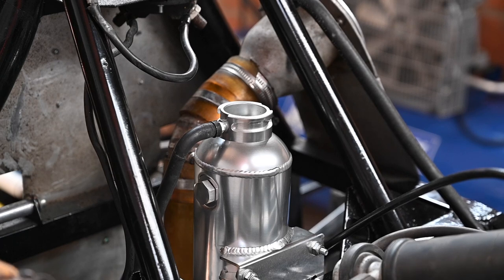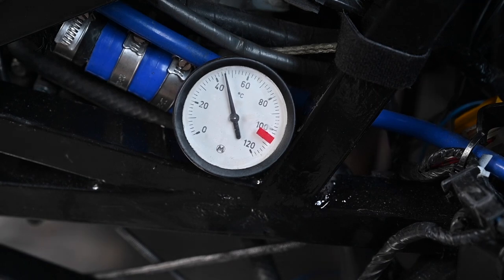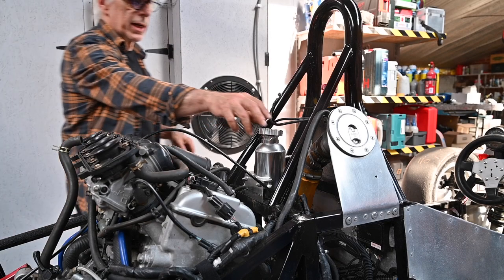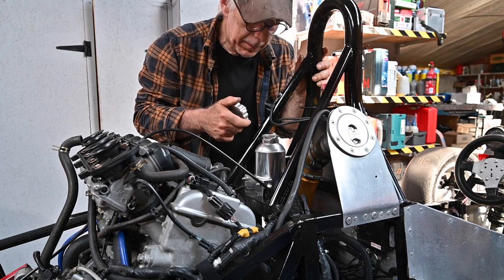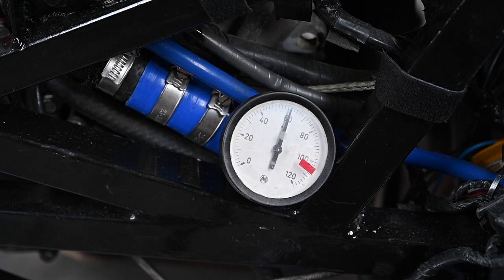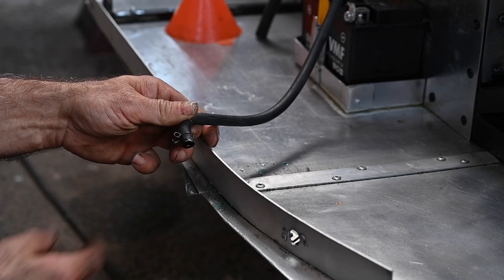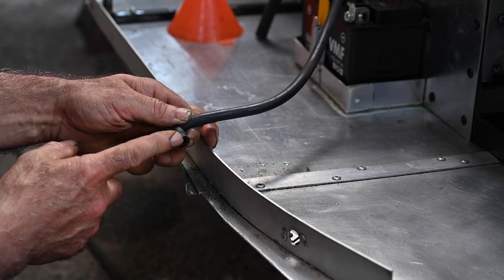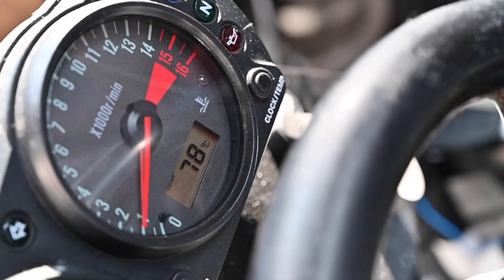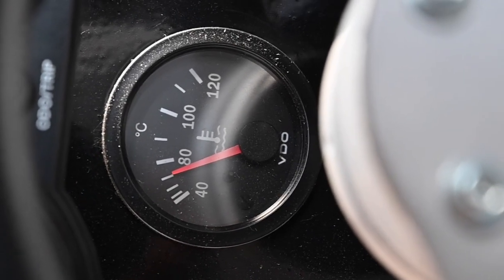With a bit of choke, let me check the liquid. I can see air bubbles coming in — still feels cold though. Now I can see the cooling level is rising, so I'm going to put the cap on. This is actually the overflow which is already connected, and there's already some water coming out of it — not a lot, but I think once the engine is even more warmed up you'll see more coming out. Anyway, this will have to be connected to a spill tank. There you have it: 78 degrees centigrade on our digital gauge and also about 78 degrees on our analog dial as well.